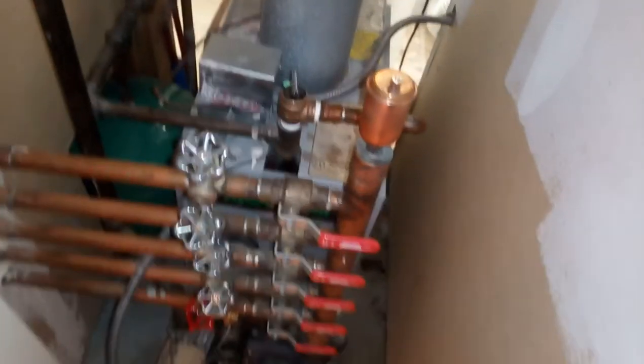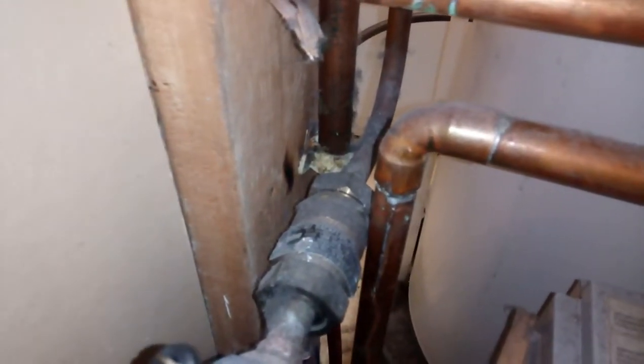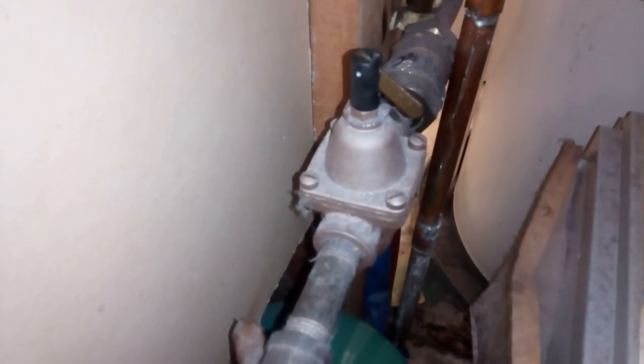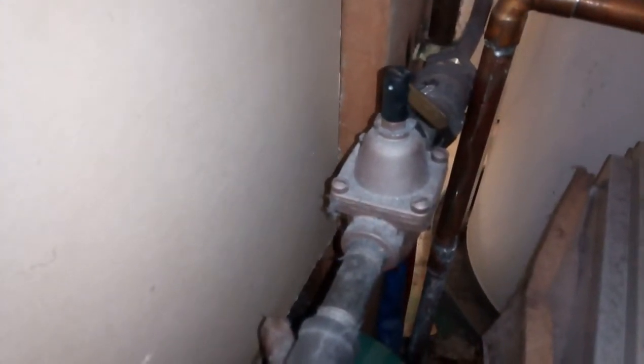In a nutshell, here's how the system works. This valve here is your main pressure regulator. Cold water comes in from the house on this side and goes to the pressure regulator valve. This pressure regulator valve holds the system to about 12 to 22 PSI. There's a lever on top — when you're flushing the system you can hold the valve open, but the incoming water pressure is probably close to 30 or 40 PSI.